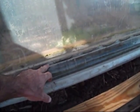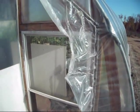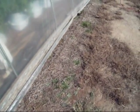I'll probably take the water hose and wash this off, clean this out. So when I pull my second layer over, it's going to get tucked right inside the same channel and another piece of wire goes in there. Back on the west end again, you can see I got my channel up, wiggle wire inside of it, going down my south wall, same deal. Took the furring strips out of the way, put the aluminum channel up and the wiggle wire, and I'm working on the inflation blower right now.